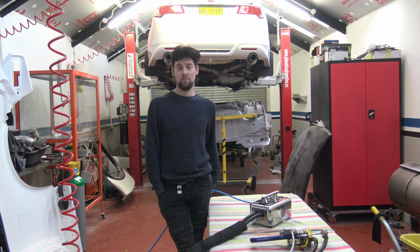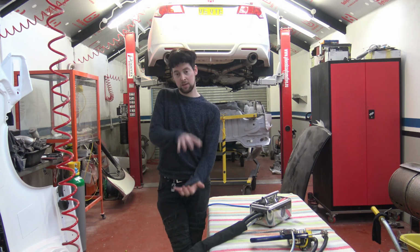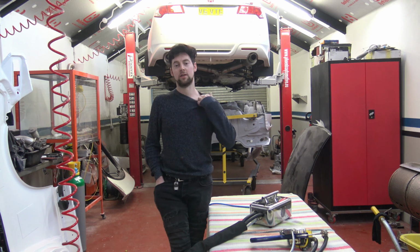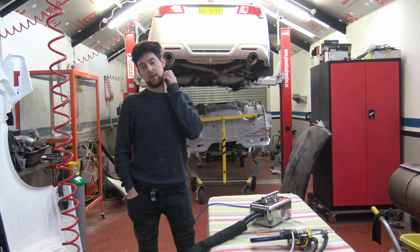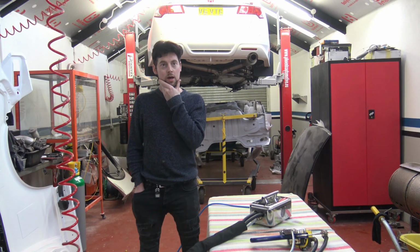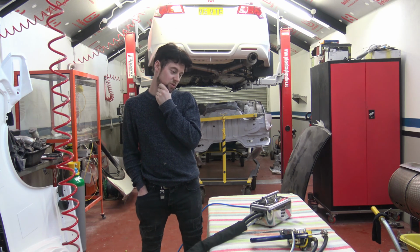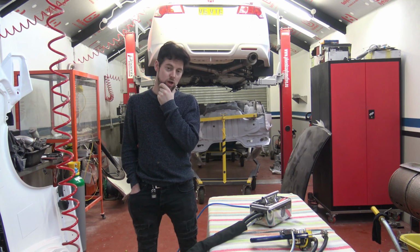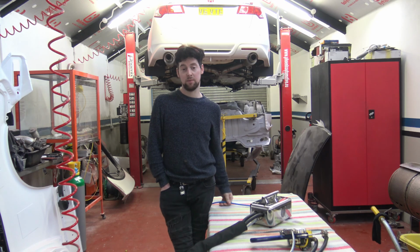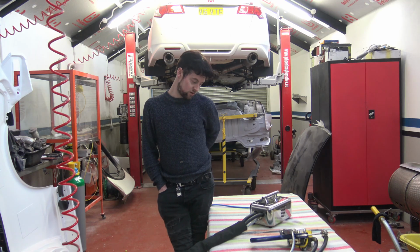I went better again and designed my own high current transformer with a bigger core, so it has a deep core, and it's really good. This transfers much more power without getting saturated and heating up as a microwave transformer does. And I have experimented with them. There's a lot of losses, and the core heats up very fast, and so that's why I went and designed my own transformer. And you will see it's very powerful, and you can hear this thing going here.